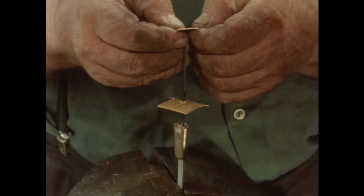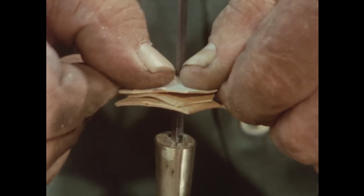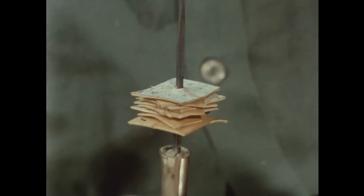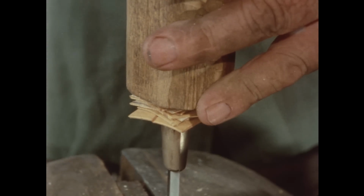When a metal figure is chased in the bark, it may break if there is a cross line in the bark. Then the handle is damaged. The Lammi family have been making sheath knives with birch bark handles for nearly 100 years. A firm handle is made by arranging the small pieces of thin bark slightly crosswise.